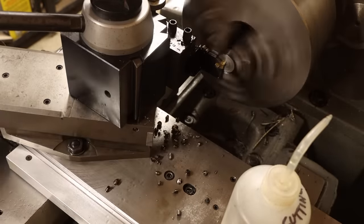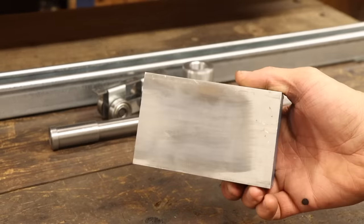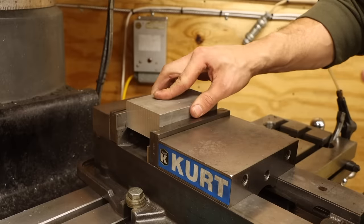I'm making pretty good headway on this shoulder joint — I've got all the stuff on either end taken care of, now for the middle bits. I'll make the shoulder body from this oversized block of aluminum, so the first step is to mill it down to size. Since my largest regular fly cutter is slightly too small for the job, I'll bust out the heavy artillery. I'll get the cutter and counterweight adjusted to a more appropriate diameter, set up for a 50-thou pass, and send it on its way. 50 thou might have been a bit extreme for a single fly cut pass, but other than summoning what appeared to be a sea beast from whatever depths this aluminum was mined from, it seems to do just fine.